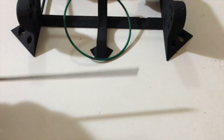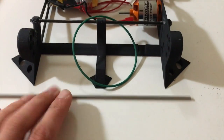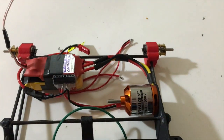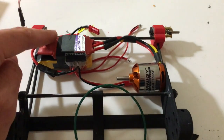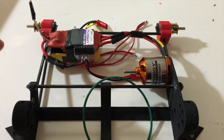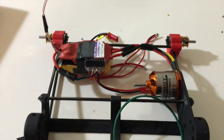I'm still sticking with this thin steel shaft because the bushings I have pair with it. If I had to do this all over again and buy all new parts, I'd go with a larger diameter rod, but I'm going to cross my fingers with that. The electronics also look the same but they are all different. The drive motors are 200 RPM instead of 100 RPM because I wasn't happy with the speed of the prototype. The weapon motor is larger and the speed controller is different — I replaced it all with parts from my RC airplane that I knew would work well. The wiring has been redone because my soldering was slightly shitty and it's better now, hopefully. Fingers crossed — I'm mechanical, not electrical.